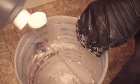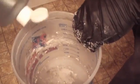Here I'm mixing in sodium silicate that I made in an earlier video. To the sodium silicate I'm adding a small amount of plaster of Paris. The plaster of Paris serves as an accelerator — by competing for the excess moisture it will set up quicker.